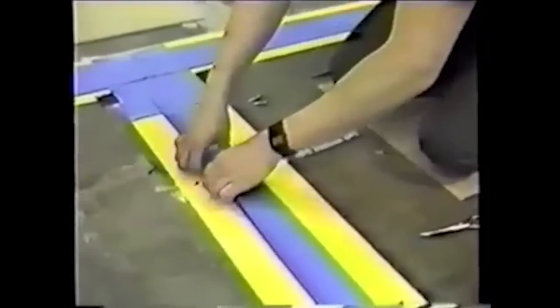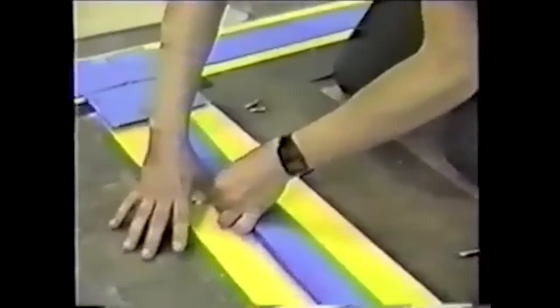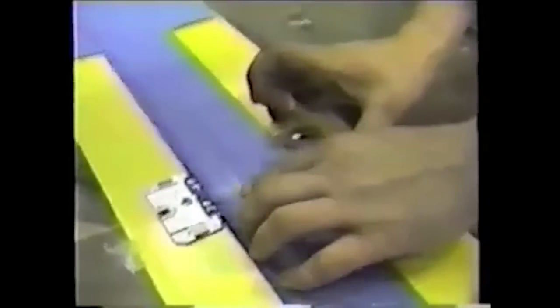Separation of the bottom blue vinyl from the cable is accomplished by pulling down on the vinyl away from the bottom of the cable. Position the exposed cable conductors and top blue vinyl between the guide locator posts on top of the floor fitting base plate.